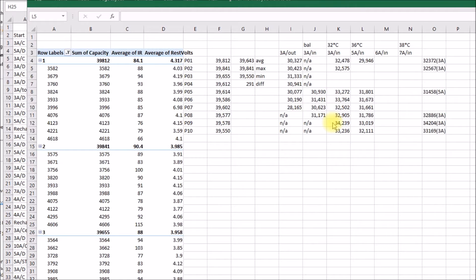Since I've finished testing packs 5 through 10, I now need to test packs 1 through 4. So what I did the other weekend was I pulled all eight groups of cells out of the cell holders. I took packs 1 through 4 which had been on the bottom half of the power shelf and moved those up to the top half — those upper four positions are easier to access, and I have the BMS on the bottom four groups of cell holders. Then to power the iCharger, I took the four closest-in-capacity packs out of the six and populated the first four cell holders with those.